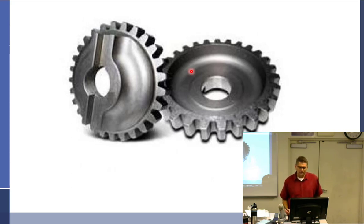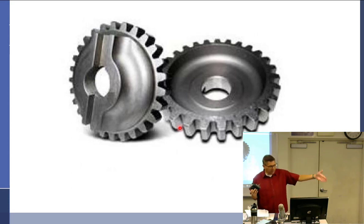Oh, but more importantly, this is an interesting thing. When you are timing one of these to an engine, Bendix, Slick doesn't have this problem, but this one, you're only limited to this much space. So put the engine where the engine's supposed to fire, you put the mag where the mag's supposed to fire, you put them together, well then you fine tune it.